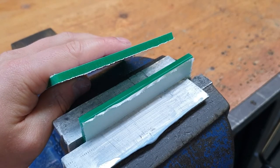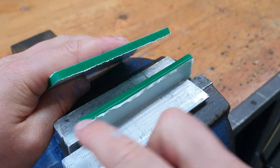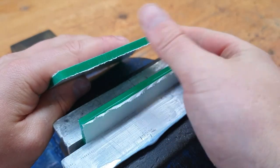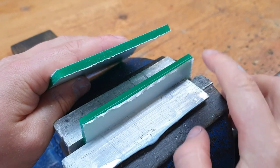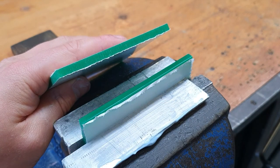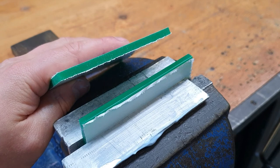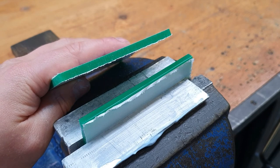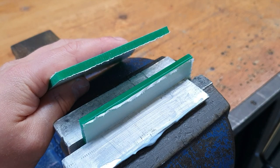Now we've finished all our steps. You can visibly see the difference in the finish — here's an unfinished piece that's very rough with visible lines, and here is a finished piece that has followed all the steps: 80 grit, 180, 220, steel wool, and peak polish. Thanks for watching everybody, and I will see you all in the next video.